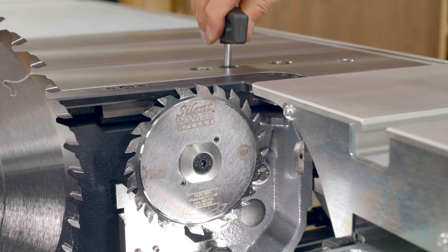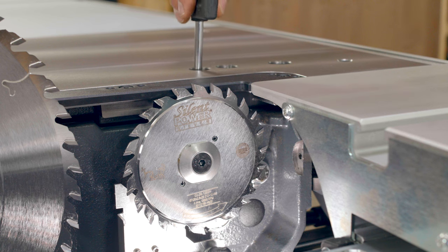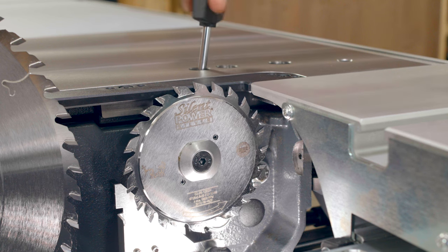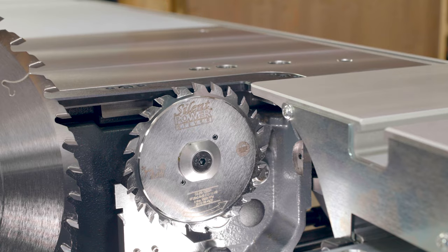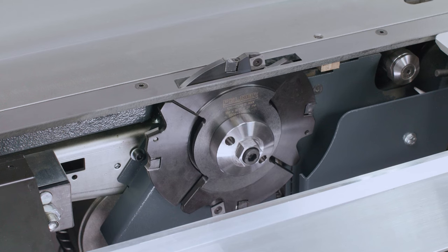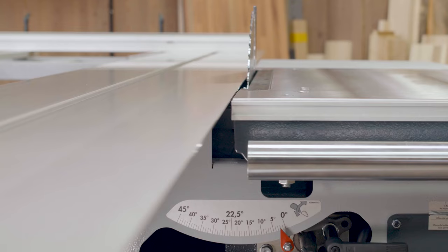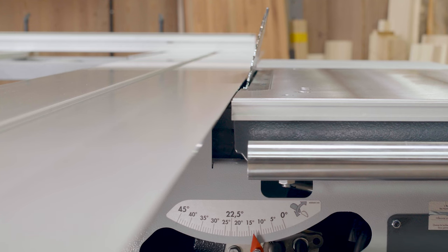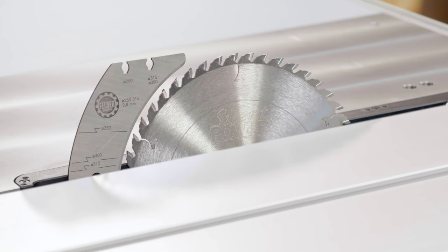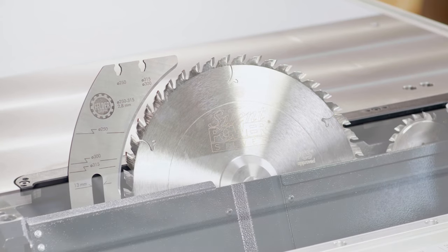For tear-free machining of coated materials, the Hammer K4 can be equipped with a scoring saw unit with a diameter of 120 mm. The possibility of using grooving tools on the circular saw arbor extends the range of applications of the K4 Perform. The Hammer K4 saw aggregate is equipped with the precision tilting segment guide, Easy Glide, and a controlled height adjustment with precision linear guides.